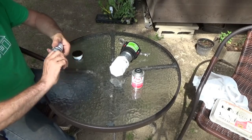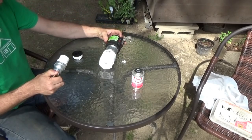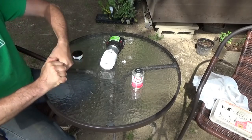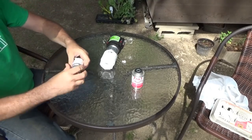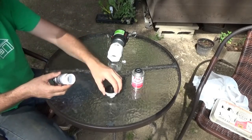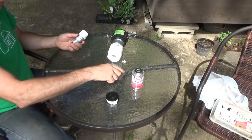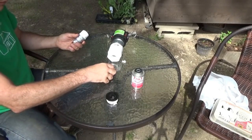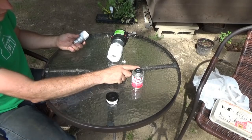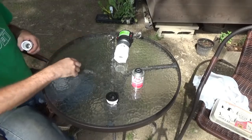So that goes in there. Now what we've got is this massive concoction that hangs onto the edge of the tote, which will come to a PVC line, which will come to all of these pieces here, which will eventually run out into the tiny house on wheels. Actually, from here I'm going to come out to a T adapter. Which runs out to a fitting for outdoors for gardening - for water hose or garden hose outside. And then from the other side the T adapter is going to come to another one of these quick disconnect couplings.